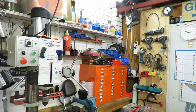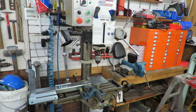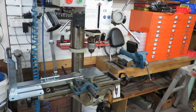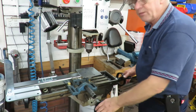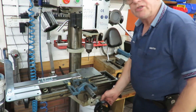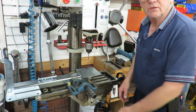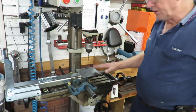The table can be raised, lowered, and shifted around. I'll zoom in so you can see the table — it's an XY table with calibrated verniers, and you can zero it at any position you want. It has flip-on handles that just flip over so they don't get knocked about.